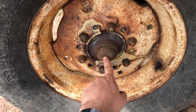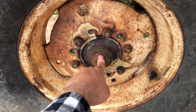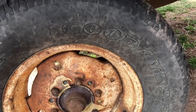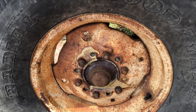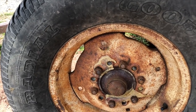If I can't get them off, my first thing I'm going to do is drill this, tap it, and put a grease plug in it, grease zerk, whatever you want to call it, and try to get some grease into these bearings right there. This one's fine, and the other three are fine, but that right front one, it'll chew out in no time. But these will be next, because this wagon has been sitting 20 plus years. So, anyways.